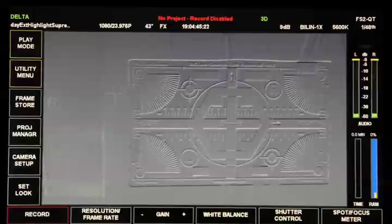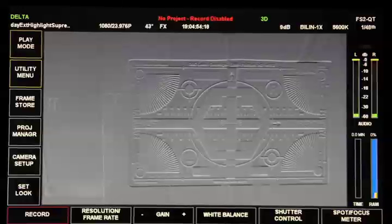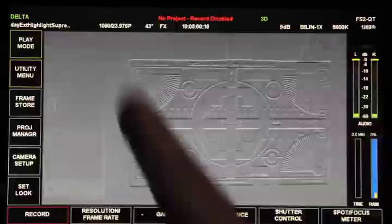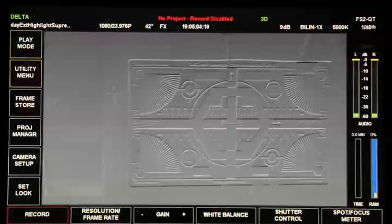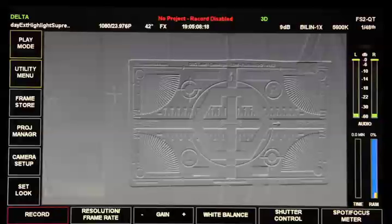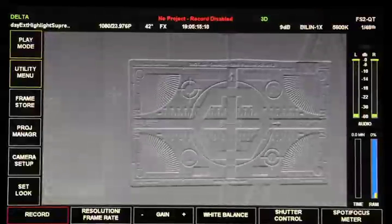I found I'm pretty close there. I'm making very small adjustments to the knobs, which means I'm getting very close to what that zero is. You'll notice that I have the lines of the chart lined up and the back wall seems pretty well lined up too. What this does is give me more areas on the chart to use as reference to find how much better I can find the alignment. So I'm going to move the pitch to line up that crosshair in the background.